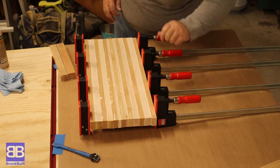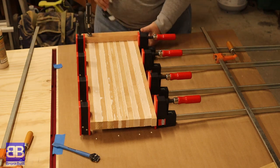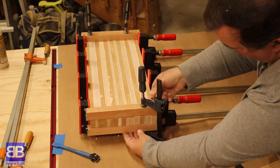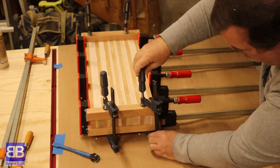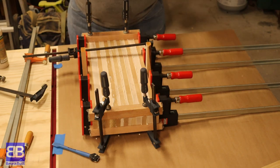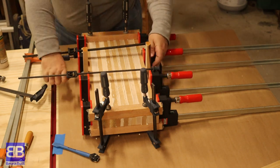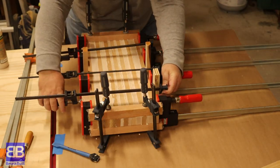It's also a good idea to let it dry standing on edge and not leave it lying flat. Because of this, it's not going to be getting super wet so the water resistant properties of Titebond 2 should be just fine. But hey, it's your world, I'm just living in it, so do your own research and make up your own mind. The key is, don't cheap out on glue. You need to have very good glue coverage. Clamping from both top and bottom will help keep it flat, but even better is to use cauls covered in packing tape so they don't stick to the board. That's really how you're going to keep your board nice and flat during the clamping process.